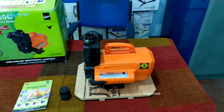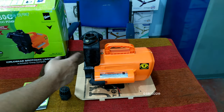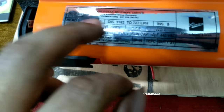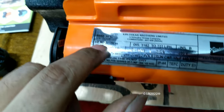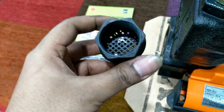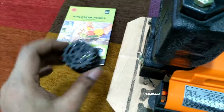This is a really gigantic pump — I have never seen such a big pump in the half HP segment. The outer casing is plastic and the pump body is cast iron. The label shows 2740 RPM, two pole, 10 MFD capacitor, Duty S1, head 6 to 28 meters, and discharge 3182 to 727 LPH. The strainer provided is fully plastic — there is no net to tear off with aging. This is a very good quality strainer provided by Kirloskar; even Crompton doesn't provide such good quality strainers.